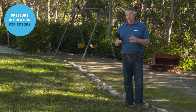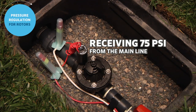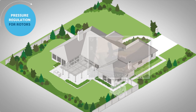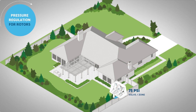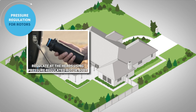The same applies to our mid-range rotor valves. We have about 75 PSI in the mainline arriving to the valve box and will be using the PGP Ultra, which wants about 45 PSI for most efficient operation. We can either use the AccuSync at the valve set at 55 PSI, or send the 75 PSI out to the heads and install the PGP or I-20 with pressure regulated bodies.